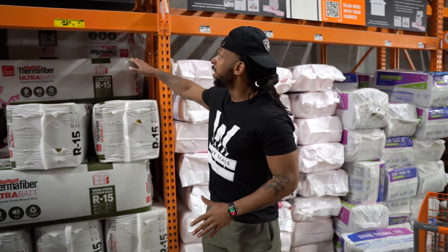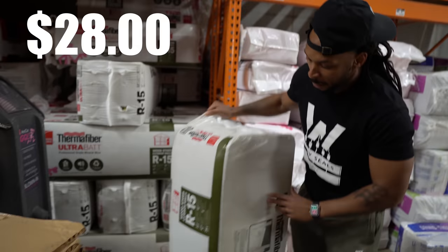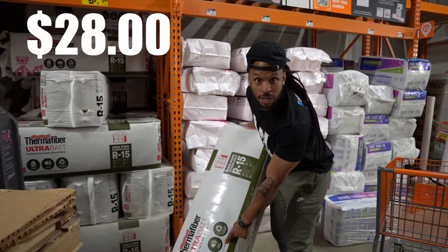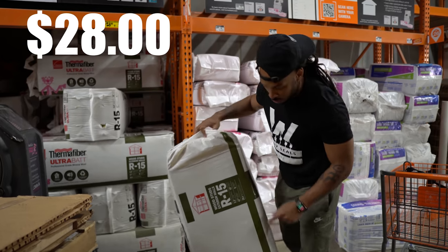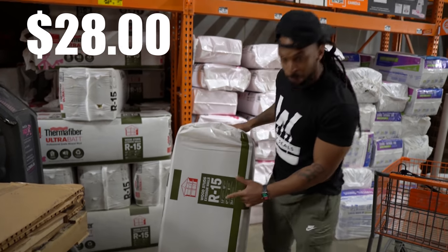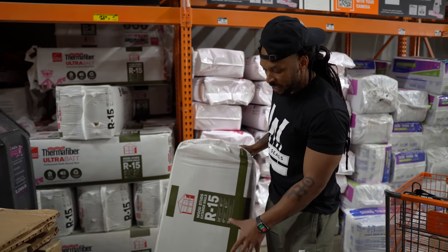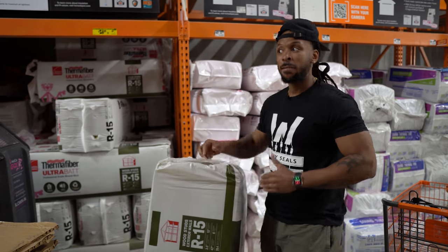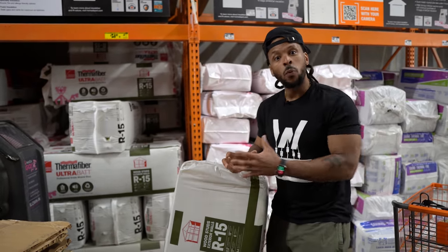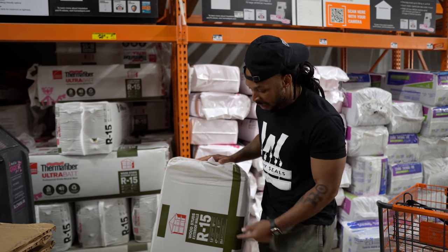All right, when it comes to the insulation that y'all need, you wanna look for this mineral wool, right? And you'll see professional grade mineral wool is treated for sound control, right? And that's one of the main things that we wanna make sure that we are looking for. Also, it has the specifications of this insulation right here, 3.5 inch thick. That way we know the wood for our frame, what size we need to get. We're gonna want something that's about 3 inches to 3.5 inches thick on that.